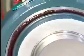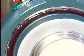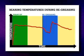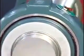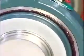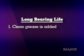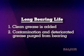If it's safe to do so, bearings should be re-lubricated while in operation to equally distribute grease throughout the bearing and minimize the temperature rise which may occur during re-lubrication. A good rule of thumb is to slowly add grease until clean grease is seen purging past the bearing seal. Imperial bearing seals are designed to purge excess grease from the bearing as the internal bearing pressure increases. There will be a temperature rise, indicated by the aid of a thermocouple inserted in the bearing housing. As the excess grease is channeled and distributed throughout the bearing, the temperature will decrease and stabilize. This accomplishes two important requirements: introducing clean grease to prevent bearing wear, and purging contaminated and deteriorated grease from the bearing.